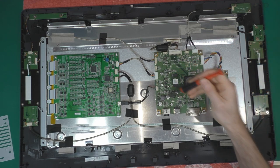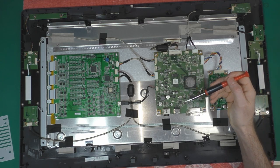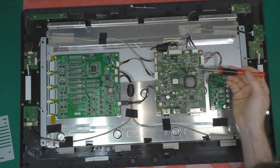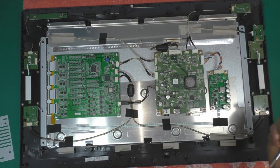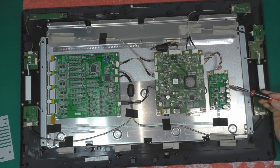So what I'm going to do is unplug the motherboard and see if I have any activity. If I don't have activity, that means the MOSFETs on the motherboard have to be changed. They are all labeled Q something. I'm also going to change the caps on the inverter board just to be sure I don't have any failing possibilities. So the big ones are 33 microfarad, 100 volt. Then you've got four of them, and the two small ones are 220 microfarad, 35 volt.